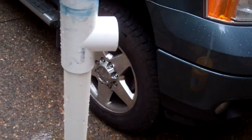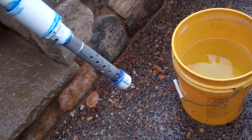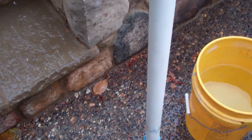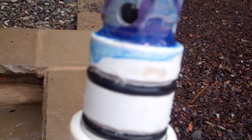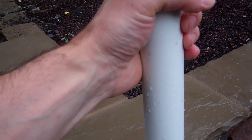If I was going to build this from scratch and buy some parts, I would probably just go to Lowe's. They have a foot valve there for about 14 bucks. But if you're in a pinch, using a marble and gluing some pieces of PVC together will work really well. Same thing with the check valve — Lowe's has a three-quarter-inch one that fits right into an inch-and-a-half pipe with a little bit of sanding. I would probably also do the same thing with the O-ring, and you could build a really nice one that would probably work even better than this.